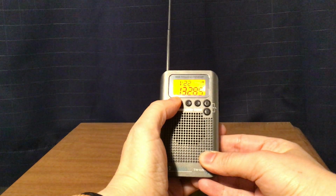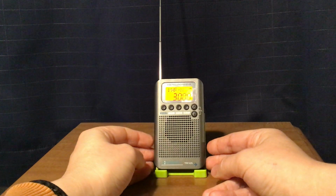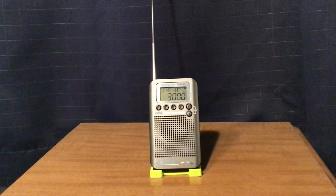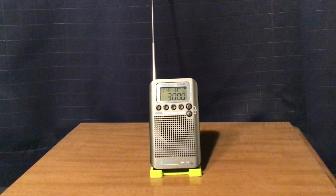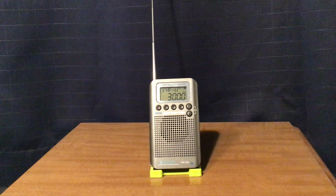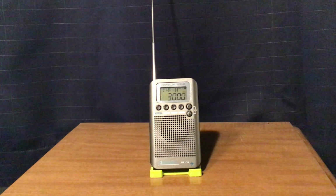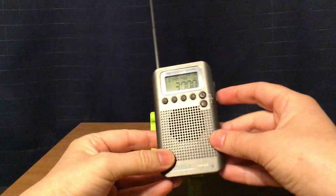Now I'm going to go into the next band, which is VHF-Y, and this is a bit of a problem, because there's a flaw in this. In the lower part of the VHF band, when it's in wide mode, I actually get imaging of FM stations, not even just breakthrough or overload, but actual imaging in that lower part of the band between 30 and 36 megahertz, which is stations between 91 to 108 megahertz. So that's definitely a flaw, and I'll show you some of that.